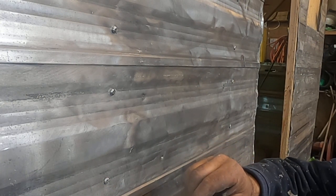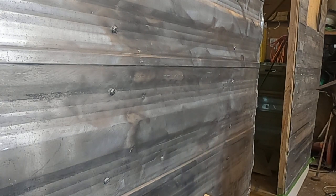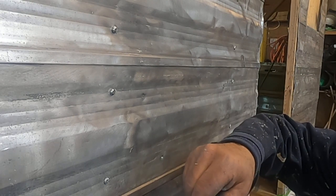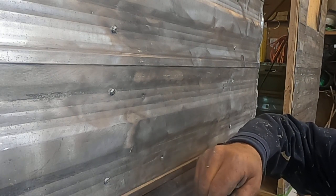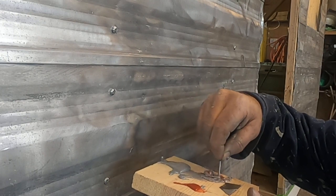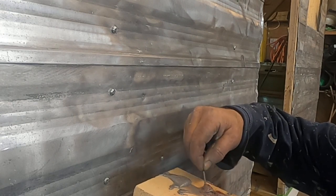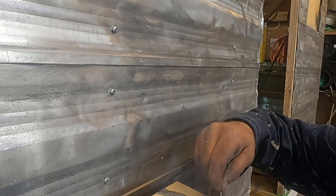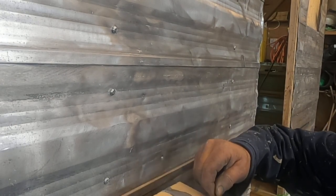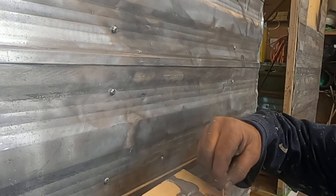I've got both here. Get them together on your little blade. Now I'm a fan of using something like a nail or a welding rod and mixing it like this. This will make a chemical reaction and this will get hot. The more red you have in this mixture, the less time you have to work with it. Now, I like to keep it, that's pretty good color. What is that? You pick a name, that's what color it'll be.